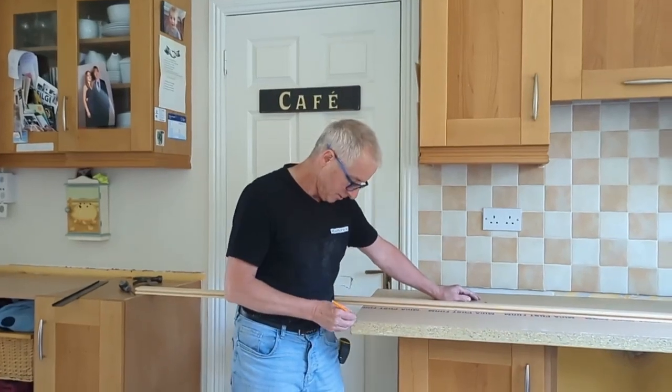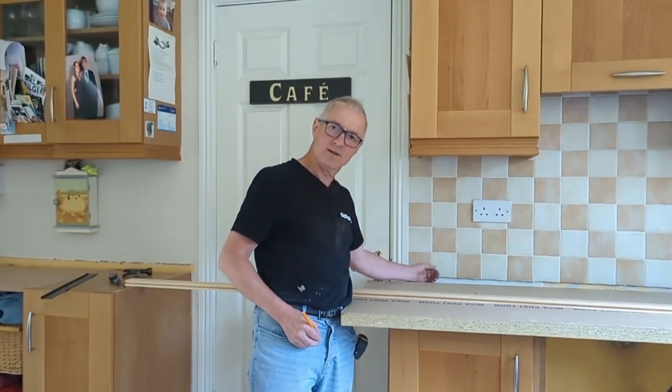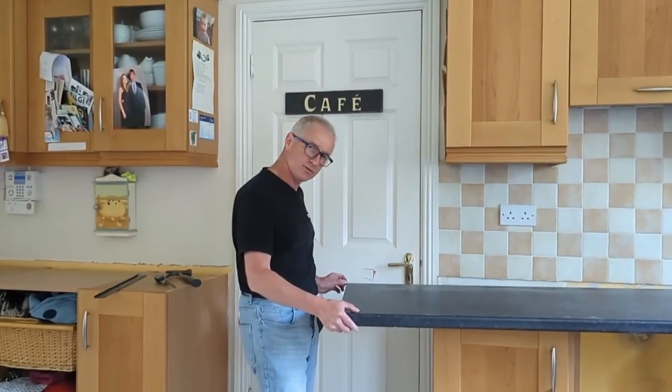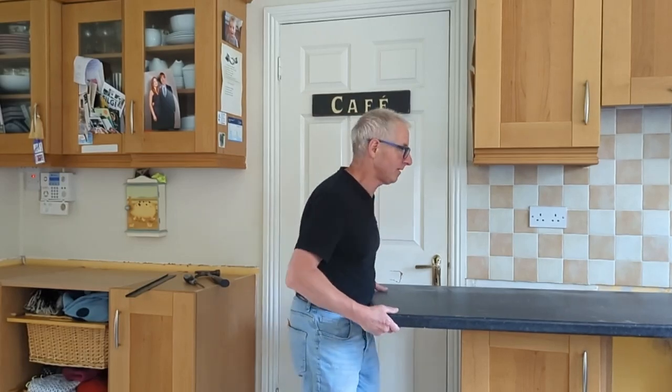What I'm going to do is I'm just going to take about 3 eighths of an inch off this here, because the tile has about 3 eighths there, plus the distance I need to take off it. It'll still sit in under the tile, so I'll just take off the back of this here — reduce it from 3 eighths at this end to nothing at the top end. So hopefully we'll fit, let's just go and see.